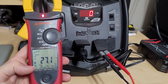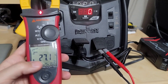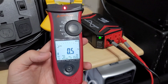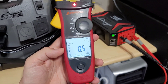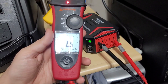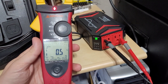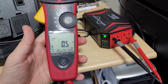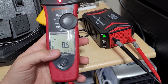These modified sine waves are okay for some devices, but for any kind of sensitive devices, this would not fly. Now with a pure sine wave inverter, we are getting a total of 0.5% total harmonic distortion — that is a very clean output. The only other issue I've shown in previous videos is that this inverter has a lot of EMI and RFI in the higher frequency range that can be filtered out, and this meter would not show that. But the harmonic distortion of the fundamental 60 Hz and all of its harmonics up to the 25th harmonic is very, very clean — better than what is on the utility.